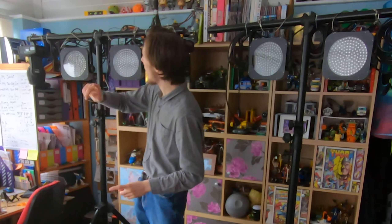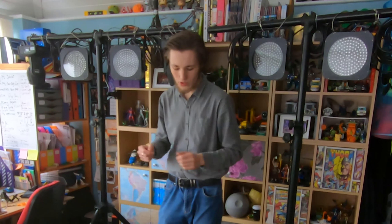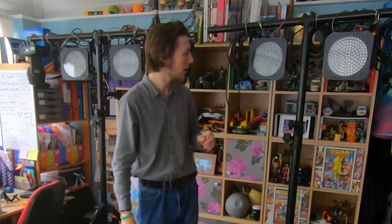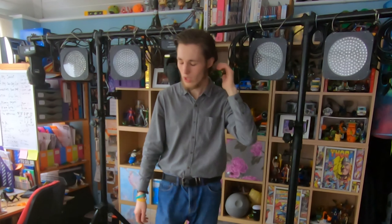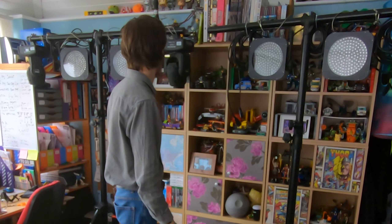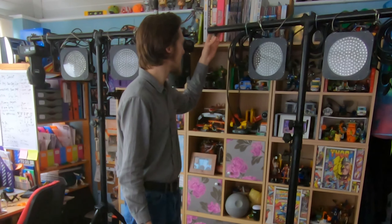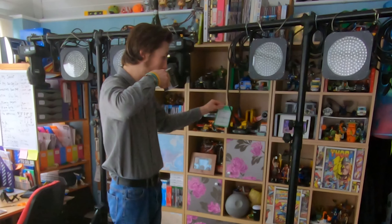The same will happen for this bar — power going up this end and working its way down — so each one will be powered individually and you can stick them at either end of the room. However, DMX will need to run from one into the other. The DMX starts over that light and gets chained from that light to that light to that light, then we need a long DMX bridge cable which comes out of this light and goes halfway across the room into this light, which then pops into that and that one. Depending on where your bars are, you'll need to think about how to hide or manage your cables.